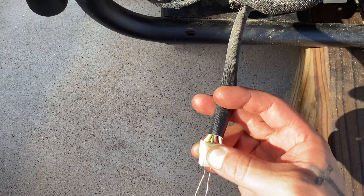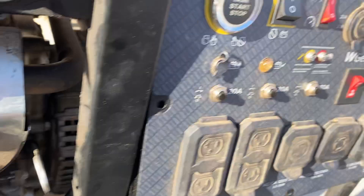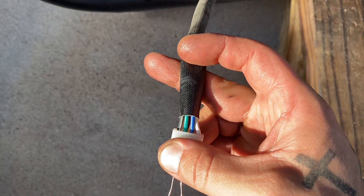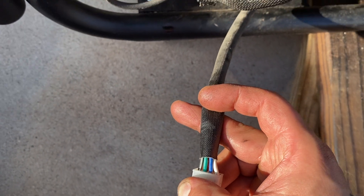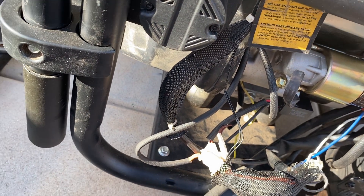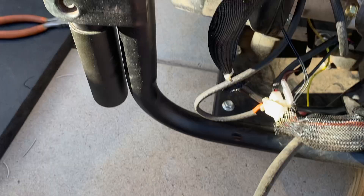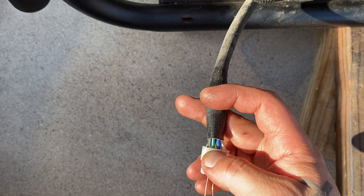If you want to know what the other wires do: the yellow with green stripe and the red one go to power those lights. The pink one goes to this transfer switch right here. The other four wires all go to the actuator — as it's called on the wiring diagram — and that takes the input from the sensor, which is obviously bad, and either keeps it running or turns it off. It looks like it brings usually a ground, so it needs to stay a low signal.